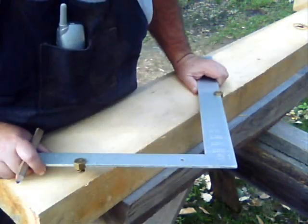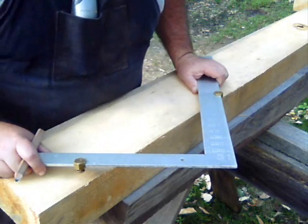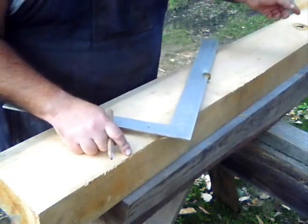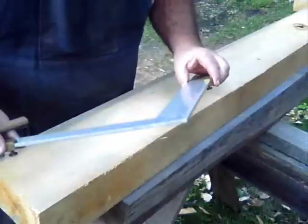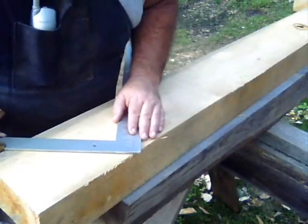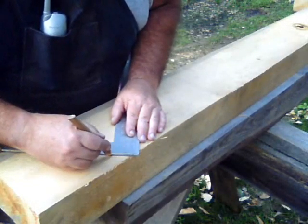I am now going to demonstrate how to use the stair buttons to lay out a rafter tail. For example, this rafter had a plumb cut at this location, so many inches down from the top. Using my stair buttons attached to my framing square, I bring the framing square in line with the dimension mark and draw a plumb cut.